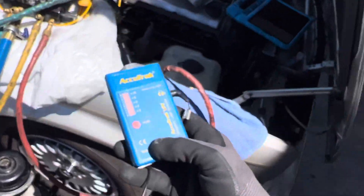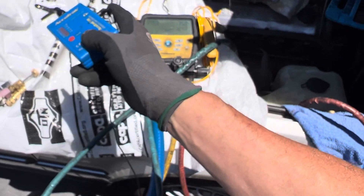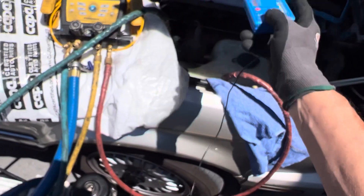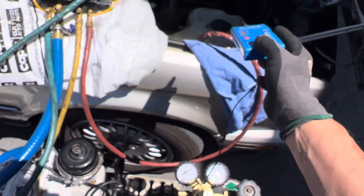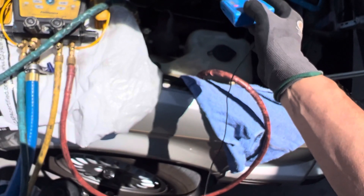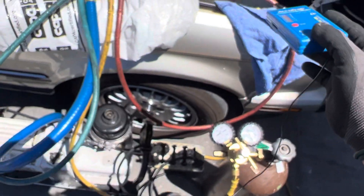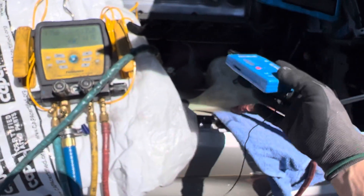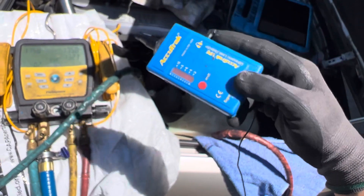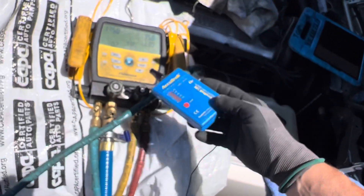We're going to jump to the next thing. We don't know if the compressor is good, the expansion valve is good, or if the electrical controls are good. I'm not going to operate the system with nitrogen in there — that puts too much stress on the reed valves. Nitrogen was not meant to be compressed in a compressor; it's too much force and you can damage, distort, and warp the reed valves, causing more blow-by. I will not start this with dry nitrogen or shop air in it — that is a no-go. You put a great amount of stress on those thin little metal reed valves. It was never designed to take the hard compression of nitrogen, and our air is made up of 78% nitrogen. So don't do that.